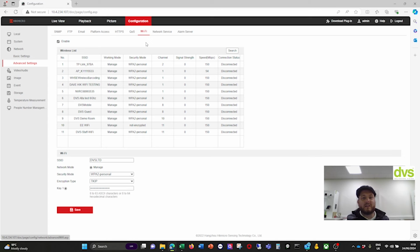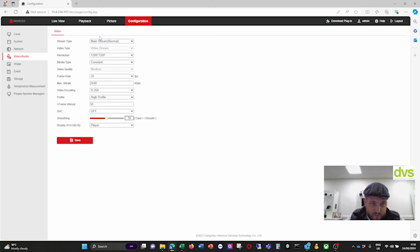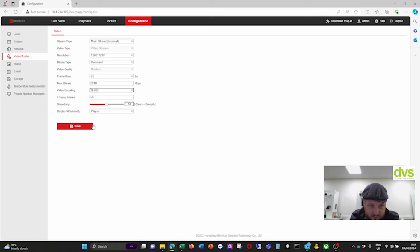If you want to use it as standalone Wi-Fi only, it will still allow you to use the HIKMICRO app when it's connected to a Wi-Fi that has internet access. So you will still get notifications, etc. using that. Video and audio, 720p constant. We'll put it as H.265.